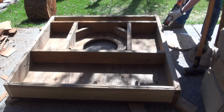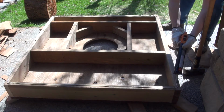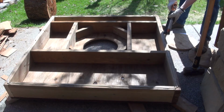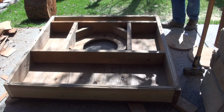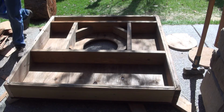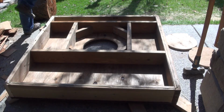Also, it just makes it so that your floor will never ever squeak as well. In home construction, they typically would put this on all your flooring and subflooring against your joists, so you eliminate any squeaks down the road. I am also going to be putting this on the framing for all sheeting, the walls included. That'll be in a future video. But for now, we're just going to be securing the floor sheeting, and we'll be going from there.